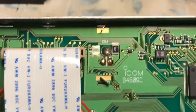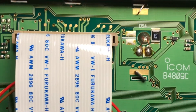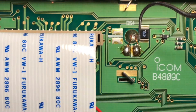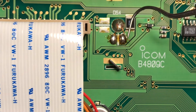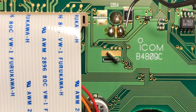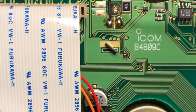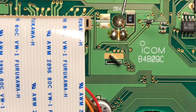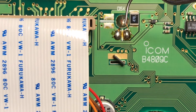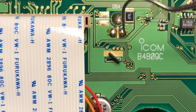I'm using a dentist pick. So basically, I just literally heated it up, got under it, and lifted it up. Now this lead is loose. I'm going to take a needle-nose plier and hold on to this lead while I desolder it — just heat it up and this will just lift right out of the hole or socket. It's actually just sitting in the hole, and the leads are holding it in with a small little bend. The leads look like the old Christmas lights.